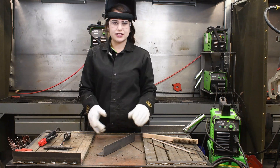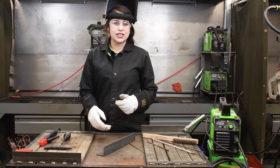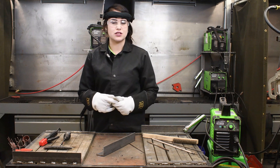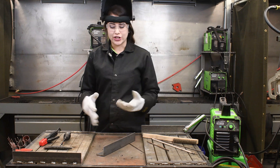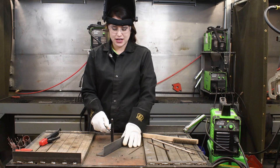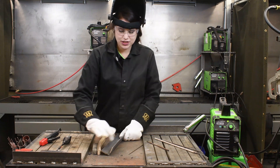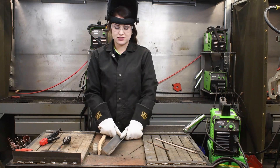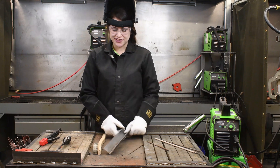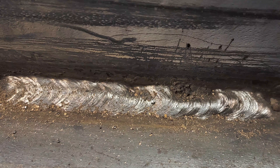So when I started and stopped, what I did was I just cleaned that slag off of that first part of the weld. If you don't clean that up, it will cause an inclusion inside of your weld, and you will trap slag in there, which can cause it to become weakened or brittle or cause it to crack if it was a high-structure weld. So once again, we're going to take our chipping hammer and chip the slag off. That weld sounded really good as well. Lots of people relate the sound of the weld to crackling bacon — that's kind of the sound that you're looking for when you're welding. We have really nice tie-in with the top and bottom plate here and a really nice fill to our fillet.